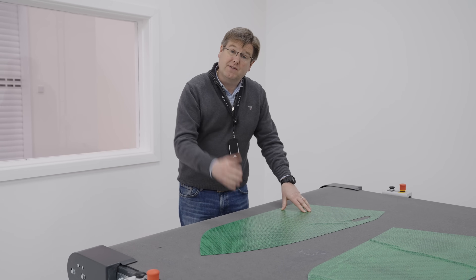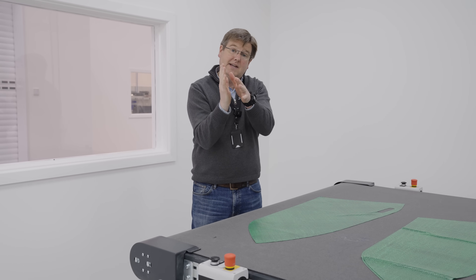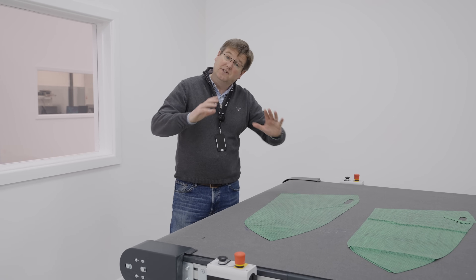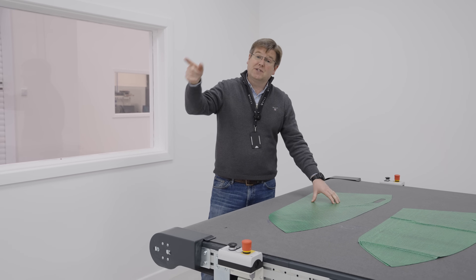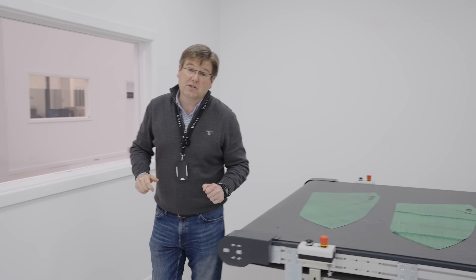On the top of the door, we close the outside by bonding on the glazing panel, and on the lower half of the door we've still got a painted carbon skin to close off those box sections and create the structural integrity that we need. With the kits cut, they get transferred next door where we laminate them into the tools.